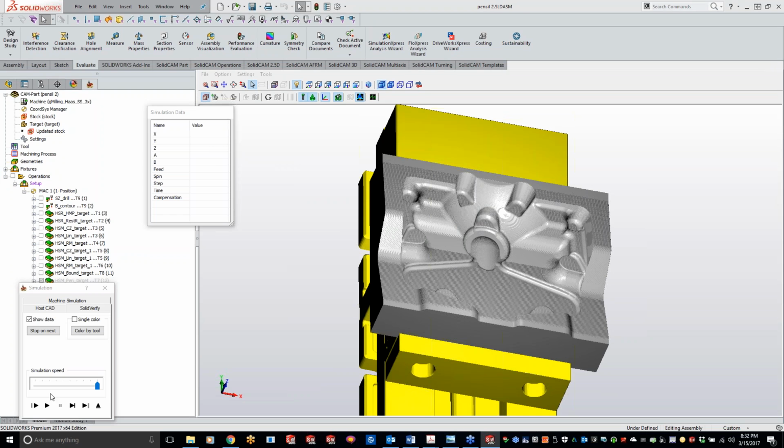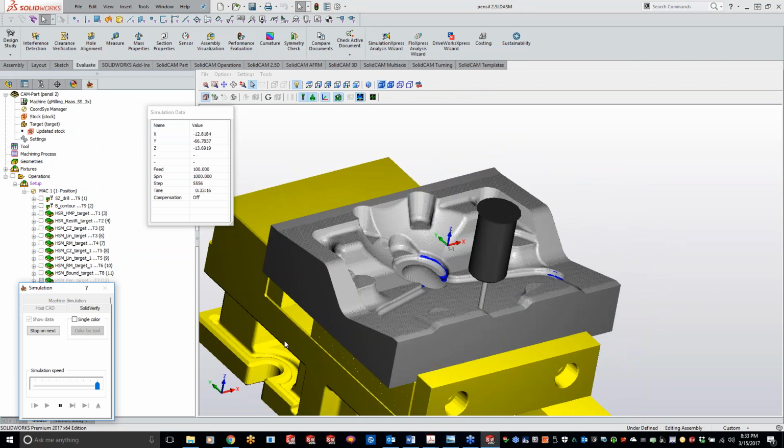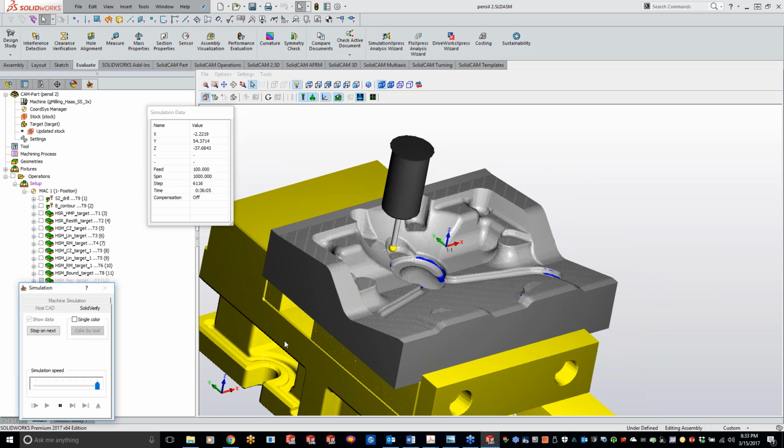Okay. Now we're getting there. So I'm going to play it through here. Like I said, just cleaning up those corners, getting nice blend lines in there. We did 5 passes in there, just cleaning up basically what was left over from the prior tool. Some spots might get hit more or less, depending on what material was left over from that previous tool. Trying to get you the best view here. Any questions so far while this is playing through? I'll actually show you this in Machine Sim from start to finish, and it's kind of cool to see that also.